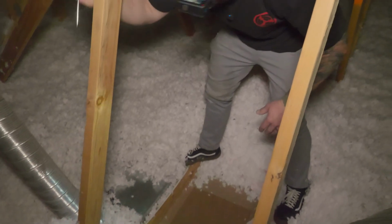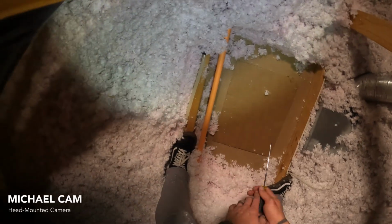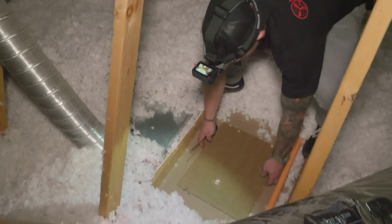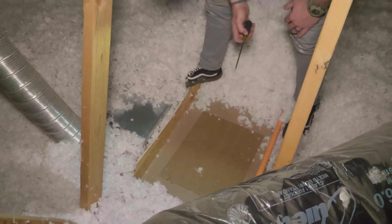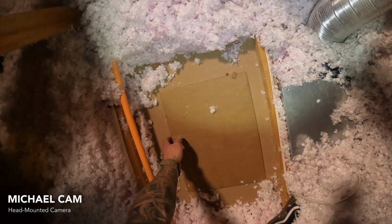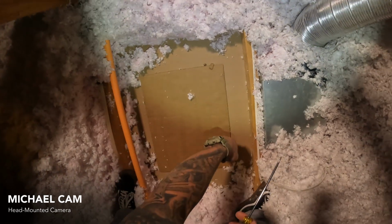What do you think? So again, I know that this bath fan has its plastic register around it. So I'm gonna give myself some space off of that truss. The sprinkler line, I'm not gonna get too close to it if I don't have to, being that if I cut out, there's a chance of nicking it. So I'm gonna just center myself in this bay, and knowing from the house side, this was my only issue to stay away from. So I'm gonna go X marks the spot on this one again. So because the bathroom fan has a grill, you're thinking that if we position our fan against the stud, that our grills are gonna overlap? Absolutely, they will. Okay, so we're going to come off the stud a little bit. I'm going to pull off of that and give ourselves some space.